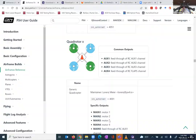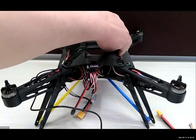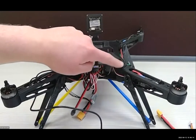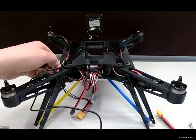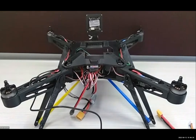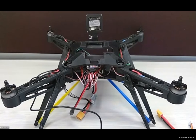Switching back over to our motor to match that out: this one over here is going to be motor 1. We need to find its channel cable and make sure it's plugged into the first channel. This one will be 4, motor 2 is right here — tracing his cable, it comes through here, up and over, and sure enough he is plugged into the second channel with black up. Motor 3 needs to go to the third slot, and 4 is here. So everything is wired correctly.